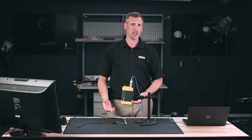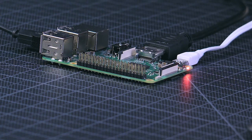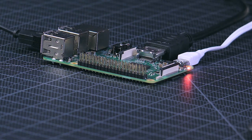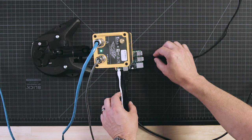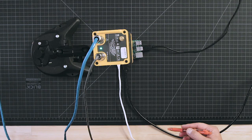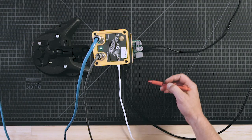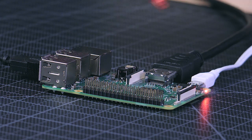If I would have done my due diligence, I would have taken a baseline image of what this looks like in good working order, and used that as comparison to find out if we're in good working order today. As we look at many of the small components on the board, we should be able to determine what's going on. Important things to look at include the ICs, the resistors, the traces, making sure there's no additional heat showing some sort of an issue.